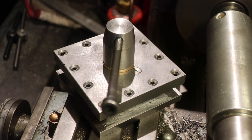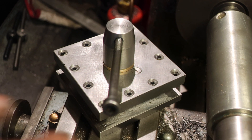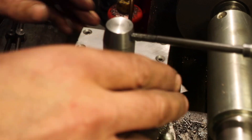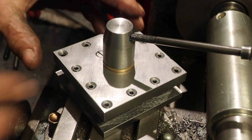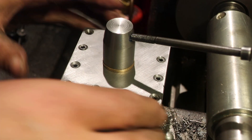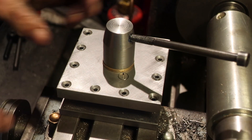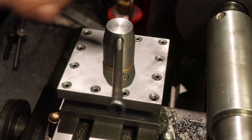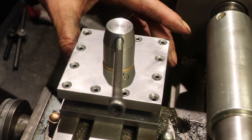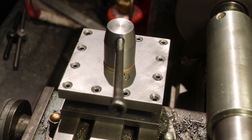And there's my toolpost, all finished — well, it needs a proper handle rather than a 6mm bolt lock-tighted into the top, but there you go. Clunk, clunk, clunk — little bronze washer, nice little flat-head screw, hand-made from a stainless 8mm bolt. You can use that to change the tension. It works.